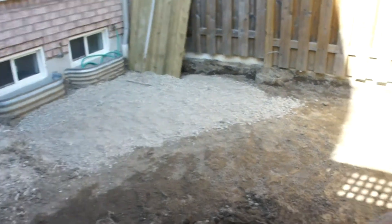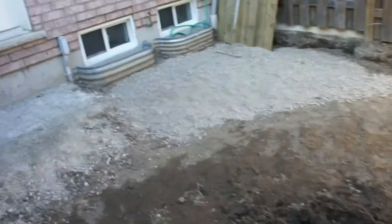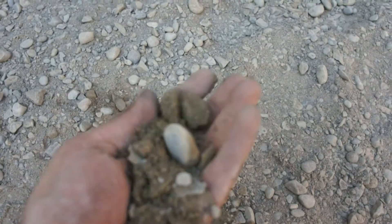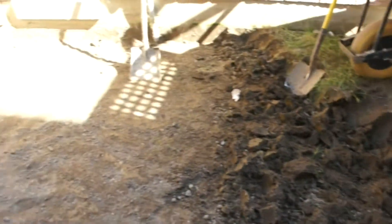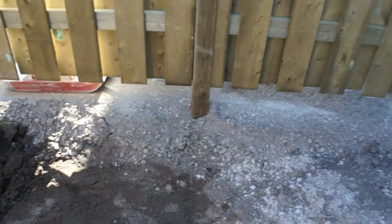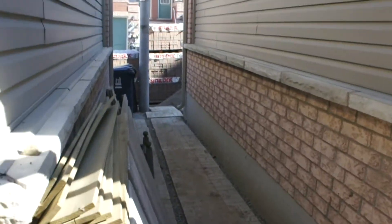As you can see, there's a lot of digging and a lot of gravel and different materials that go in. Here's what I mean by granulary — there's your granulary. So we put that down, compact it, and then just like the other side, it'll be about six inches of granulary, one inch of sharp sand, and then your stones go down.